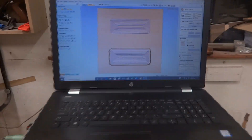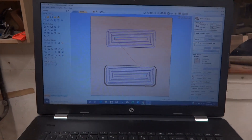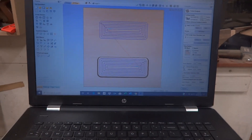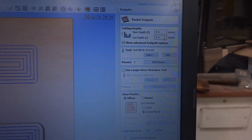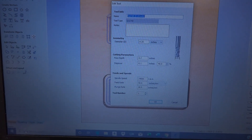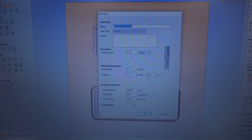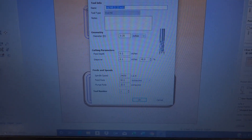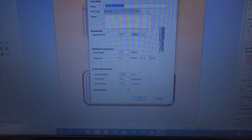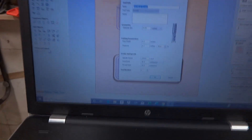We'll come over here to the computer first. So what we're going to be doing is cutting two pockets. The top pocket is going to be cut in the conventional method and the bottom pocket is going to be cut with a climb cut. As you can see, we're going to be cutting 0.4 depth, which is two passes — 0.2 per pass for a total depth. We're running 50 inches a minute, plunge rate of 20. We're doing a ramp in, so the plunge doesn't really matter that much. Our step over is 0.1, so we're running about 40% step over. I've always used a conventional cut on this machine — I've owned it for almost two years now — and just something I've always done, never tried the climb cut. So that's why I wanted to run this test and see what happens.